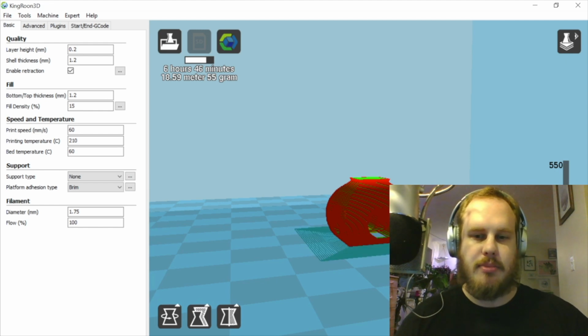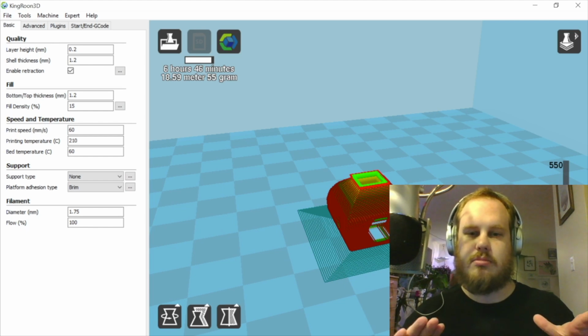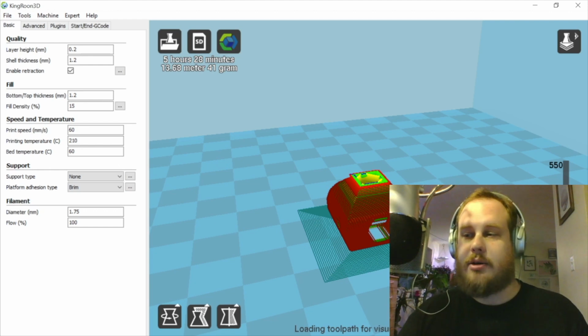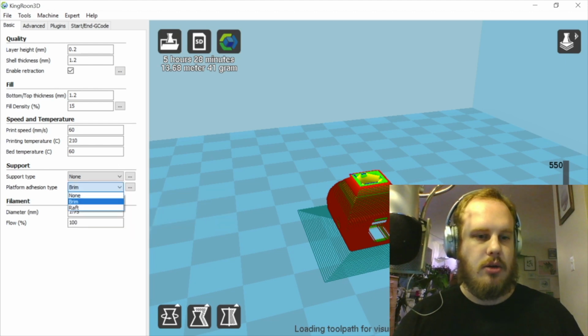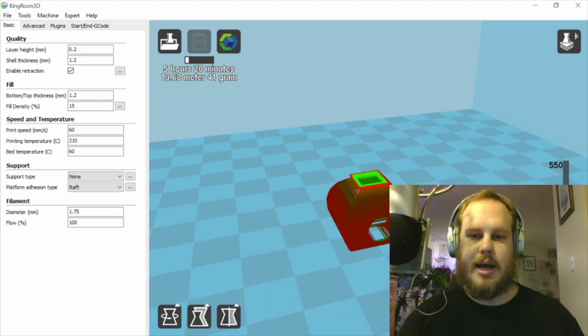There you go. There's the brim. It just does a single layer piece that helps with adhesion. It's kind of like a suction cup almost, the way that it works. It widens the surface area so there's more to hold on, so that the whole part doesn't tip off, or as things cool, it doesn't pop off or tumble. That's actually how I've managed to print this ornament. Now a raft is actually like a brim, but it's multi-layer and it has an air gap.